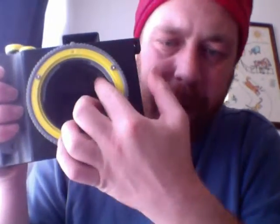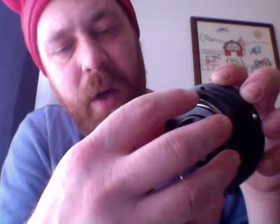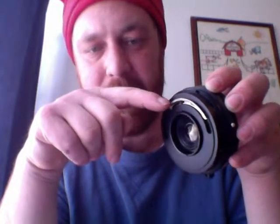But what I wonder is maybe, so on the back of the lens, as you focus, there's this cam, maybe the 50 goes all the way around, and it's just hanging up on the sides. So there's a lip that comes down like this as a light baffle. Maybe it's not actually hitting the light baffle itself, but it's just sliding inside the light baffle and catching an edge, in which case I would feel fine opening that baffle up by scraping with the edge of a chisel or just sanding.